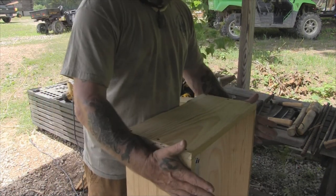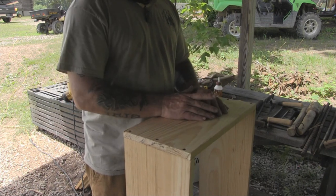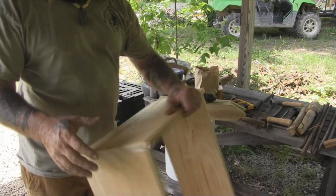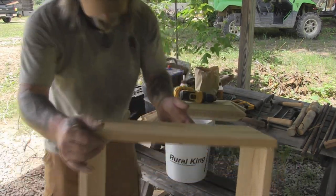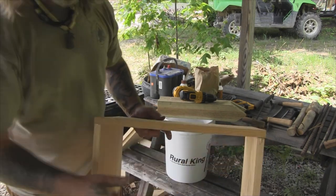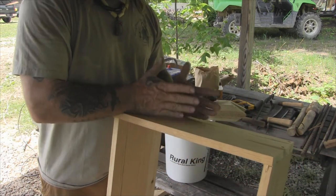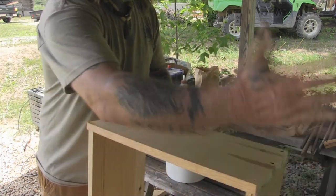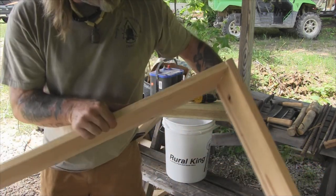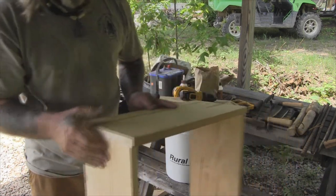When we're done we'll put a glue line in there and screwing this together will cause our joint. I'll also show you an old-school way they used to join two pieces butted up against each other linearly — called a pinch dog. I was just talking about how good dimensional lumber is, but it's funny because I just put this board on and it's flush on both ends, yet it's sticking up probably a quarter of an inch on one side. So somewhere these boards aren't planed to the exact width. It's not a big deal — I can just take a veneer of wood off and adjust for that before we screw it in.